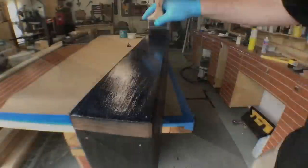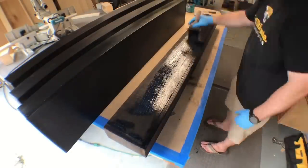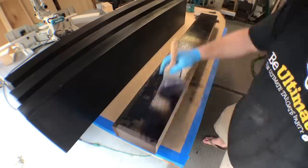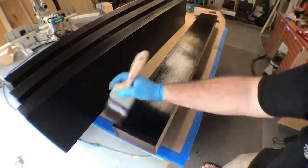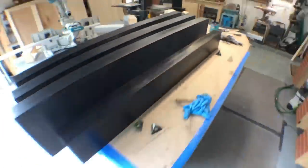With the big propane torch I take light passes on each side, torching the pieces up nice and dark. Once they've cooled down I finish each piece with a little bit of polycrylic. Things are looking good — no stain, no nothing, those pieces are looking awesome.